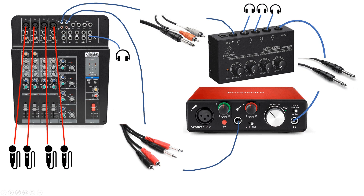Now we can plug headphones into all three of these slots and control the levels individually. We could plug in four headphones if we didn't want to use the mixer. But instead, we're going to use one of these cables — TRS to RCA, or TS to RCA — and plug that into one of the headphone slots. From there it goes all the way back over to the mixer into the tape input. That allows us to monitor the sound through the mixer headphones, using the Two Mix control to increase or decrease volume. That's the full setup — thanks for watching.